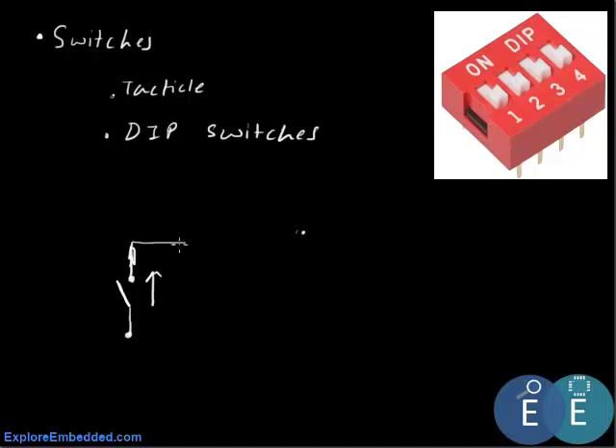Say this is a microcontroller pin — P3.0 or any other port. If we tie this to ground, whenever we press the switch the pin grounds and we have a logical 0. But in order to have a logical 1, what we do is connect it through a pull-up resistor to the pin. So if this is R and this is VCC, whenever the switch is open the VCC pulls it high and we have a 1.